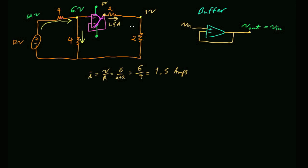The point is I'm doing this to illustrate a concept. Now I've set it up so that the voltage divider applies on both sides. As long as I've obeyed those rules, I can use the equation. The buffer did a really neat thing: it kept the voltage the same, but it provided a very important service — it essentially decoupled the two sides of the circuit. It let the voltage travel through, but not the impedance. Those electrons arriving at the intersection, instead of seeing the combined impedance of the bottom node and the right node, now just see the impedance of the bottom node. It changed the impedance seen at that node but didn't change the voltage — which is a really cool trick.